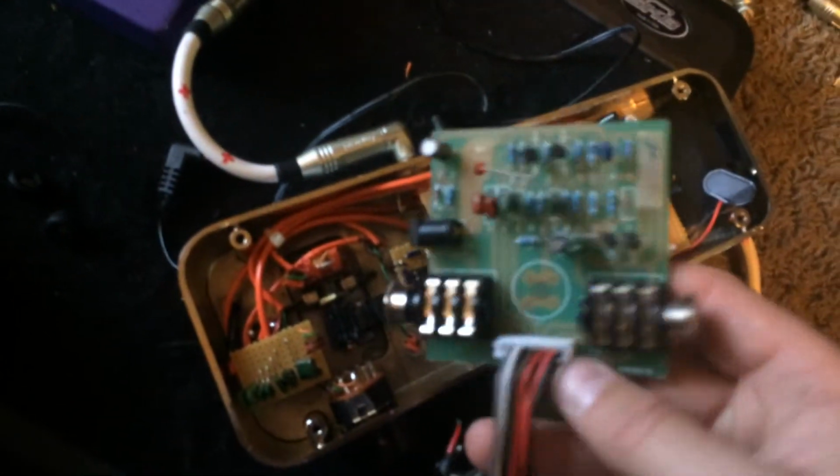So on the inside, it's just entirely gutted. Probably turn off the laser beam LEDs. iPhone camera doesn't dig that. So, stock board, you know, one of these crappy, weird Darlington pairs, just because they probably wanted to save money not using the right transistor. So this is what you get in a regular crappy version of the China wah. So right up here, you notice the cap rotary. It's got the different caps. So that's what really changes the tone most dramatically.